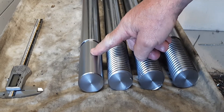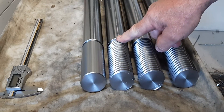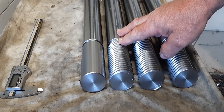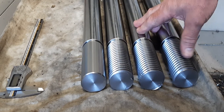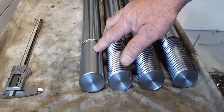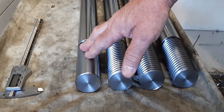The prep on the shaft is — because they do get plated — I've had to skim down the size of the shaft to allow for the plating. I've been caught out before and had to recut the threads after they've come back from plating, which is a pain. I set it back up in the lathe and it was my fault so I didn't get anything for it. I had to recut all the threads on the previous job. I did take them undersized but obviously not enough, or the plater put too much coating on.